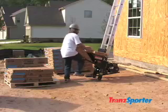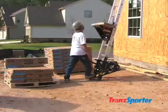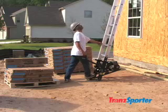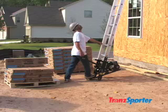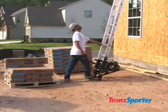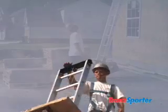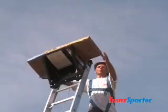In order to raise the carriage assembly, face the platform and stand as far back as possible from the hoist. Place your foot on the foot control brace and press to engage the motor to the drum belt. This permits the carriage assembly to roll up the track sections. When the carriage reaches the top, release foot brace immediately. The self-energizing brakes will automatically engage.